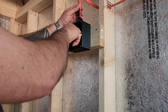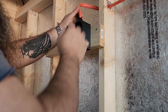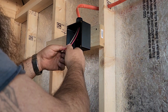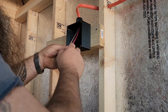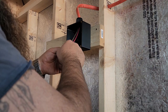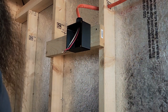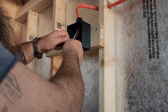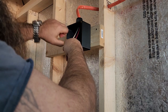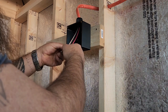Okay, so as you can see, I've got the wires going through here already. I went ahead and spliced, I got the coating off the outside. What I will tell you about the coating is, when you have this wire, you just want to skim some of the coating off the bottom. That way, if you damage the coating of one of the inside wires, you're just right here at the bottom instead of being way up here and damaging it up there, and then you have to cut it back even more. Once you've got a little bit of the coating, you can grab a wire, if you can get a good grip on it, and try to pull that wire a little bit and see if it'll split, or you can just split it with your thumbs enough so that some of it is coming off the side where you can actually grab the coating. Once you can grab the coating, you can just pull it up like that and it'll split right off. Then just cut off that coating, and you haven't damaged the coating on any of your inside wires.